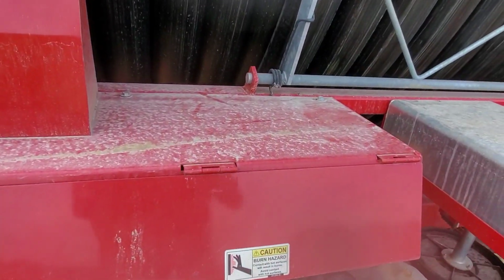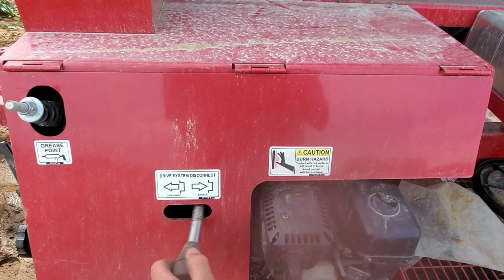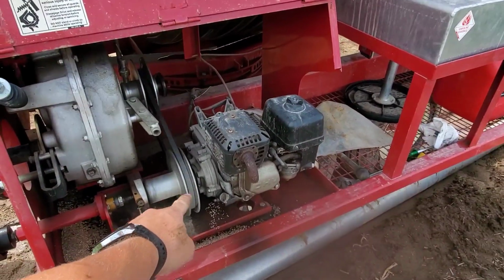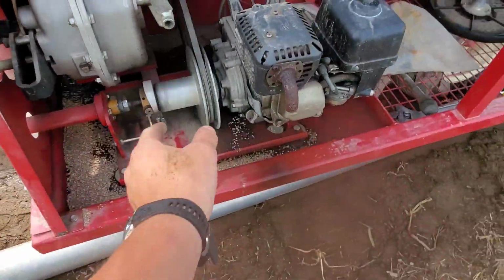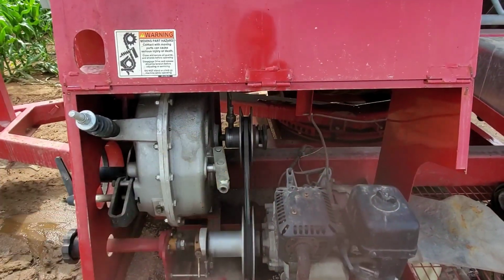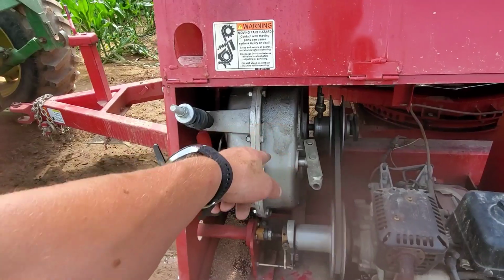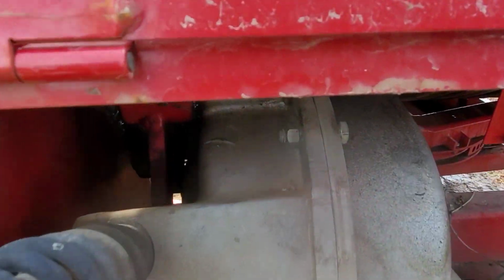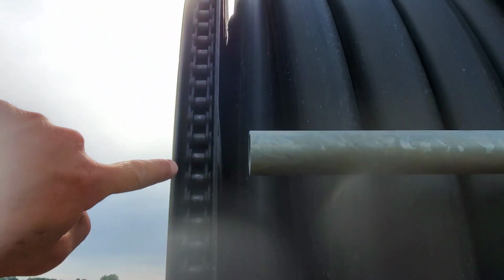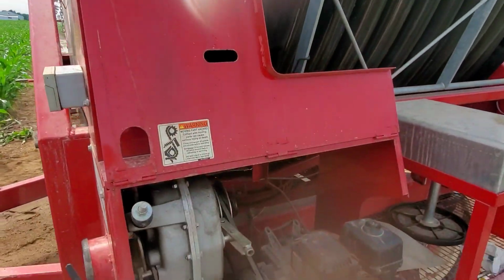While we're explaining how stuff works, we should probably talk about how the Traveler works and reeling stuff in. Basically our motor turns, and there's a variable speed sheave in there, and I can adjust this handle and it pushes that pulley, it changes the gap, which changes the circumference of it, and changes that one to change the speed, variable speed, right? And it spins this gearbox, which reduces the speed down, and there's a chain in there that spins, and that chain goes all the way around the drum, and is what spins it, and it reels it in.